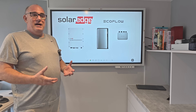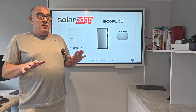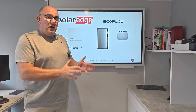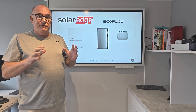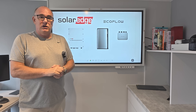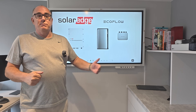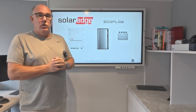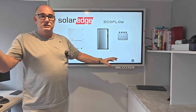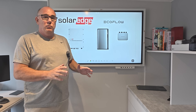The way I have my system set up is that my large 10kW inverter is what I call my demand inverter - this is the one that ramps up and down as there is demand. The other two systems supply a consistent baseload; they don't care what the house is demanding. The EcoFlow PowerStream connected to the two Delta Pro batteries, at 5:30 in the morning when the Octopus Intelligent Go cheap rate finishes, will start supplying power and will supply 400 watts from 5:30 in the morning all the way through to seven o'clock at night - irrespective of whether the house needs it. If the house needs it, it consumes those 400 watts; if it doesn't, it exports to the grid. It does not change - it just sits at 400 watts.